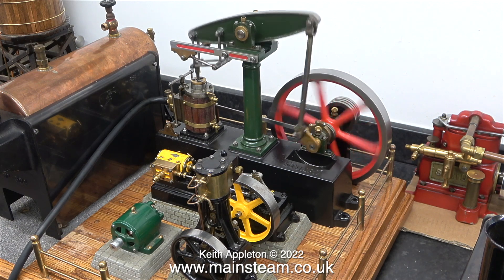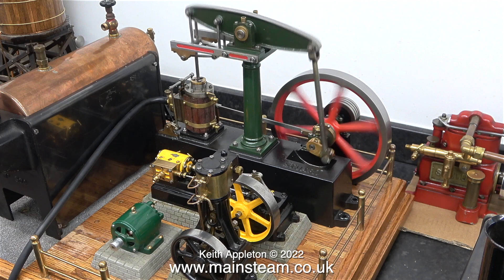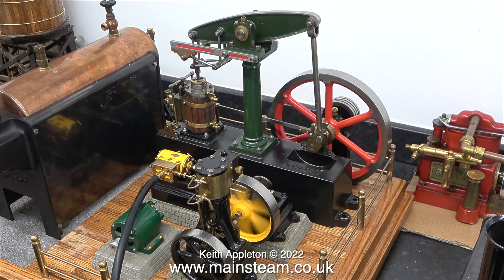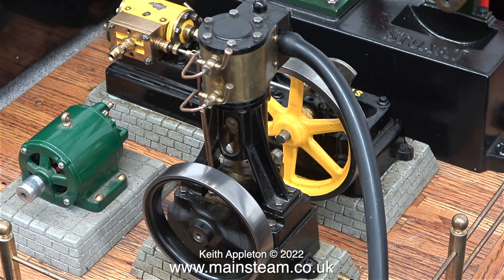Here I'm carefully giving the engines a brief run — particularly the beam engine, because the pedestal isn't fastened down, hence the slight knock. This is quite a good layout: from the front you have a number 10, an S50, and a beam engine, and the flywheels go up in size with each engine. I definitely need to look at the slide valve on the number 10 — it's not making the right noise. The problem is steam being blown to exhaust before it does any work. I'll slow the video to quarter normal speed so you can hear it better; at this speed you can clearly hear that the engine is very wheezy.